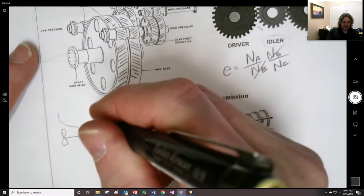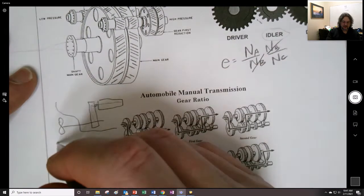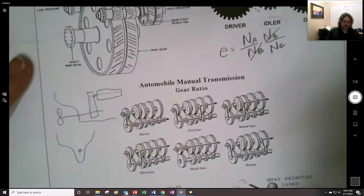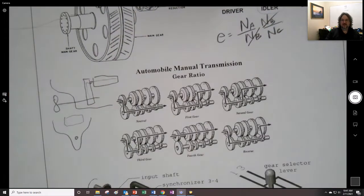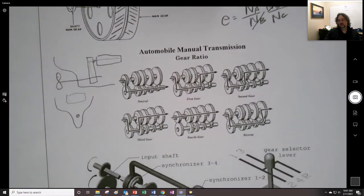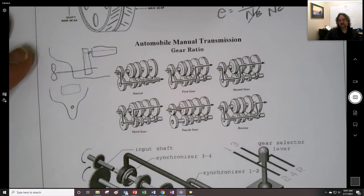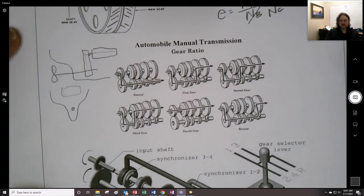You can almost think of it as being a Z that's necessary, because if you take a look at the ship, it has that shape, where the propeller is on that level right here, but the engines need to be up higher because they can't fit down in the narrow part of the ship. These are design constraints, not just for a ship, but for many different applications. When you're trying to design something in general, there are going to be some physical constraints that factor into the decisions you make.